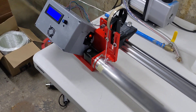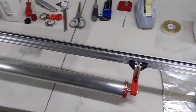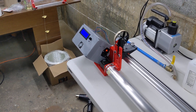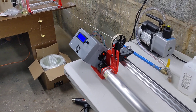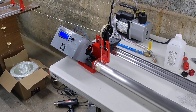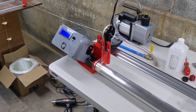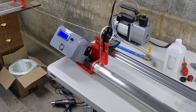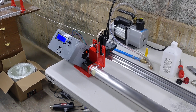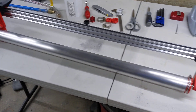Same design, everything else. This is a 2 1/8-inch aluminum tube by 3 feet. What I'm going for right now is speed. Last night I wound a tube on a 1 1/8 mandrel and it took about 40 minutes — that was three layers. Really trying to cut down on time. I just did an empty sequence and it took nine minutes to get through the first layer, and I want four layers for this tube.